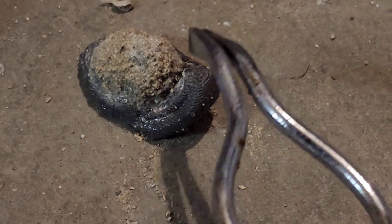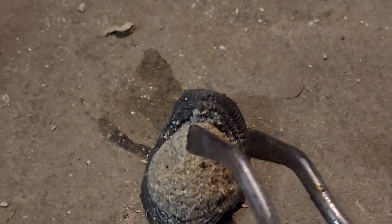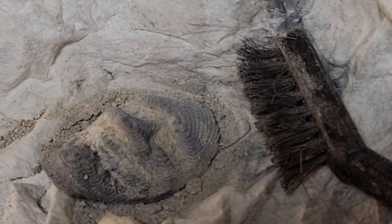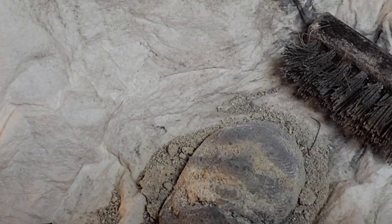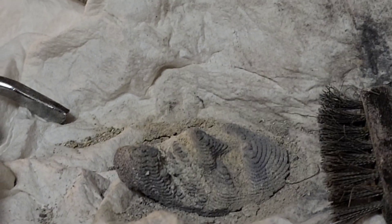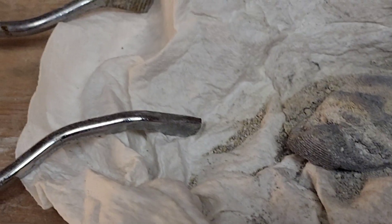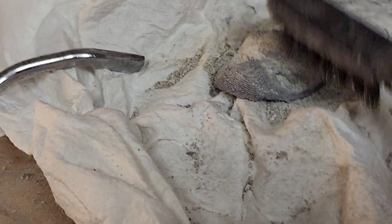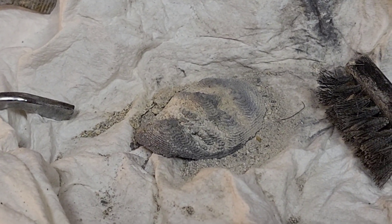We've tested a few things during that little shop aside and we're getting a little closer, but this part still isn't quite right. After a little bit of cleanup, we seem to have a semi-successful aluminum Hanya mask. This is very small, so some of the detail was lost. The horns seem to have fallen off, but that may have been during shuffling or something during the sintering process. This does seem to be quite hard — I'm scraping this off with a steel wire brush and nothing seems to be deforming.